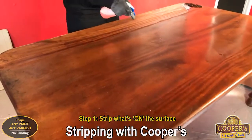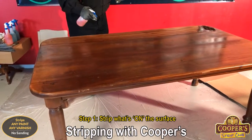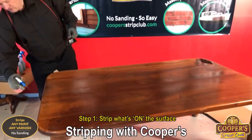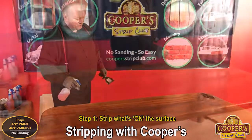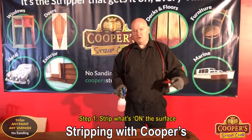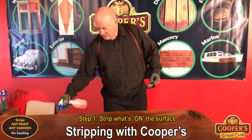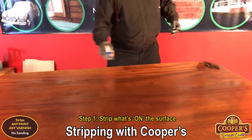This red one's our stripper. Very, very thin. Normal strippers are very thick. We make our stripper thin so that it absorbs rapidly. Our stripper is virtually pH neutral. We don't want to damage the wood. We don't want to bleach it. Acids and alkali based strippers do more damage than anything.